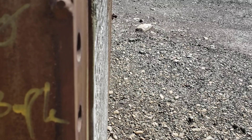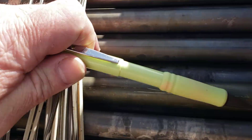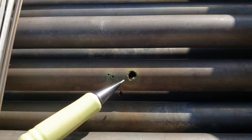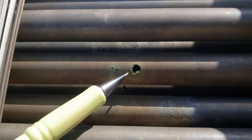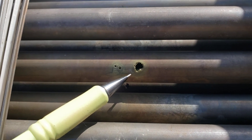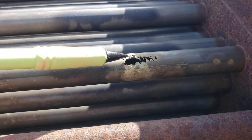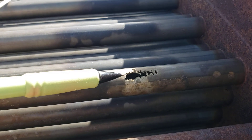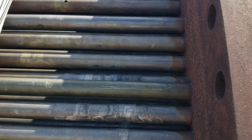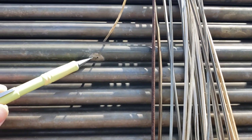I don't know if I'd call this normal or unique, but I wanted to show you some of the corrosion where it's definitely preferential and it has corroded through the tubes in multiple locations. Here's one, and there's another one up here where they've just completely corroded through. This entire bundle is a write-off — it's completely failed.